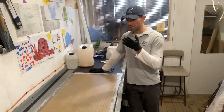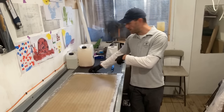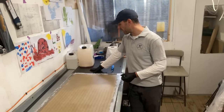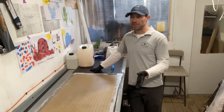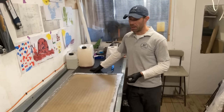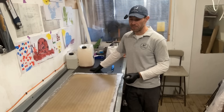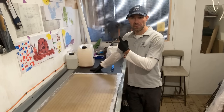I could see at the end I mixed up a tiny bit more resin because it hadn't quite fully filled the weave. In most circumstances you do not need to vacuum bag your laminations. You tend to do that more in high-end race boat applications where you really want to minimise weight and get the glass-to-resin ratio absolutely right. For this application it's just a backer. I very, very infrequently vacuum bag because it's just not necessary for most applications. But if you want to give it a go, it's quite good fun.